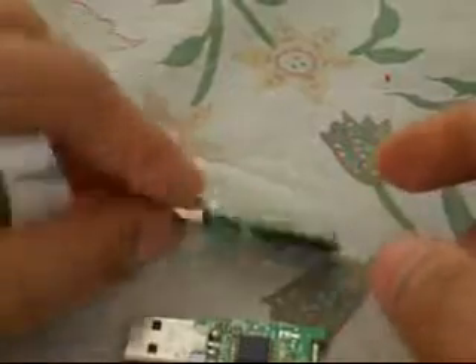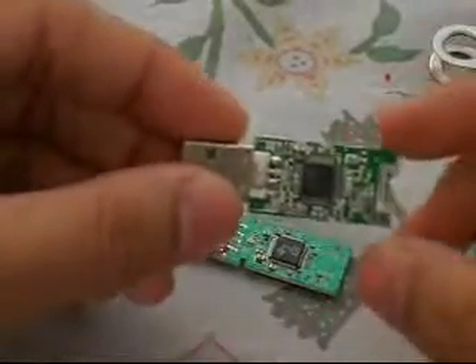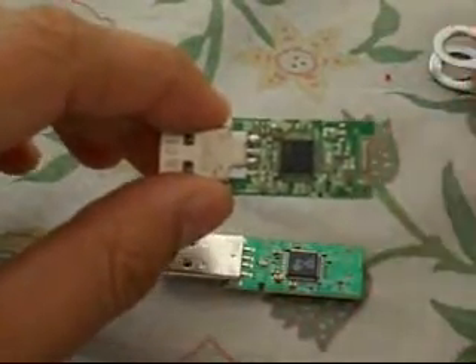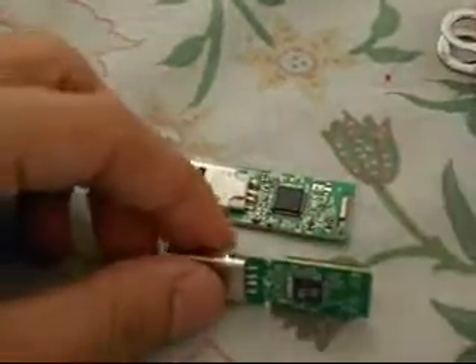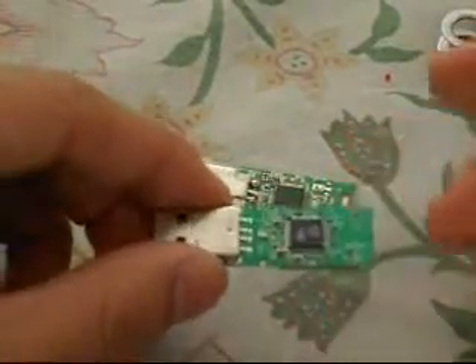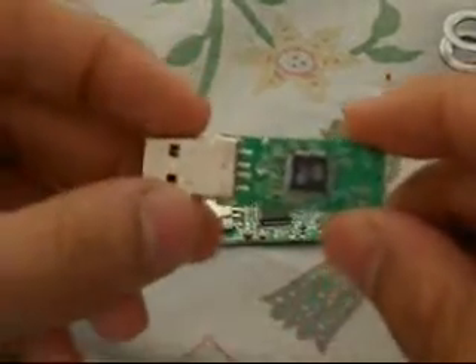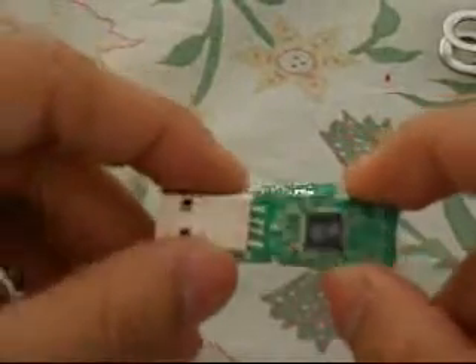So what is this cylindrical thing? I suppose it is a crystal oscillator. A crystal oscillator oscillates and sends out electrical waves, and those waves help in coordinating the data — when and how the data will be written, and synchronizing instructions. In this 8GB pen drive I can't see any crystal oscillator, so there must be some internal oscillator built into the microcontroller itself.